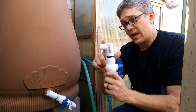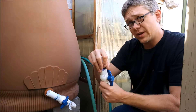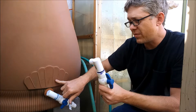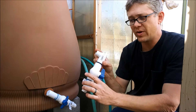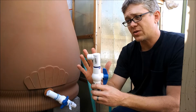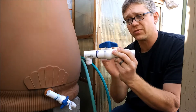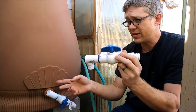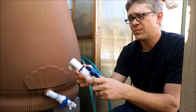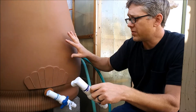If you go with an angled fitting like this, you have to be concerned about clearance. I glued it all together and then tightened it on, and I actually nicked the front of the barrel on the bottom of the ball valve because it's a little bit wider than the rest of the fitting. If that's a concern, you may want a connection that just runs straight out and accept that it sticks out a little further, or you could screw it in first — but then you won't be able to remove it without cutting it apart.